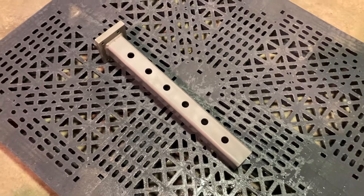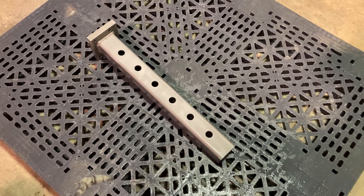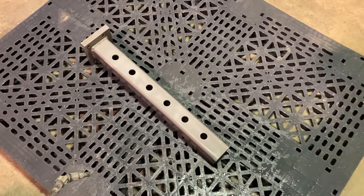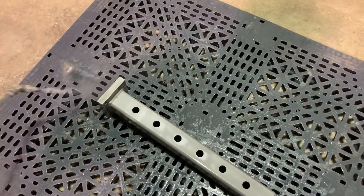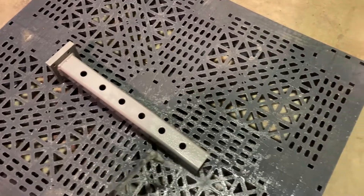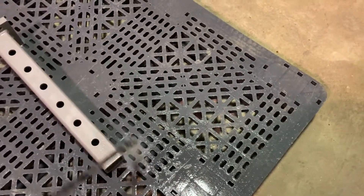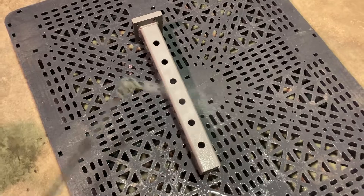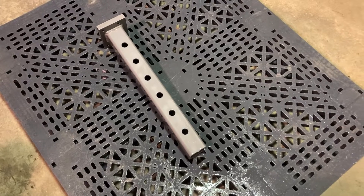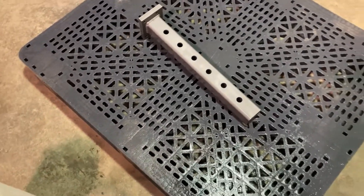This part's pretty clean now, and you're probably thinking it's wet and it's gonna rust — and you'd be right. So what we're gonna do is spray an iron phosphate pretreatment on it. It's gonna convert the outside layer of the metal to a more stable form, and keep it from rusting — at least as long as we need to deal with it. It also gives you time to do any masking, coat it, and get it in the oven without flash rust occurring.